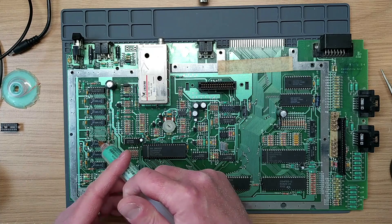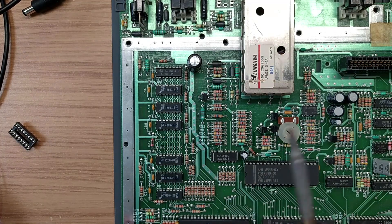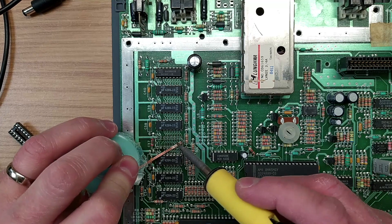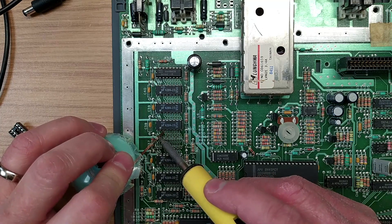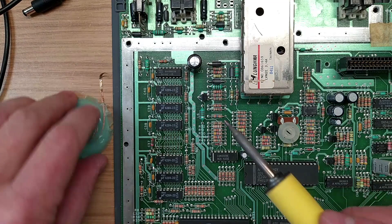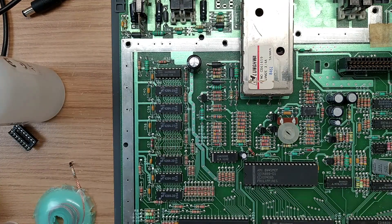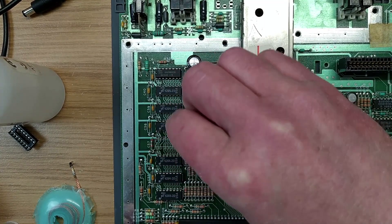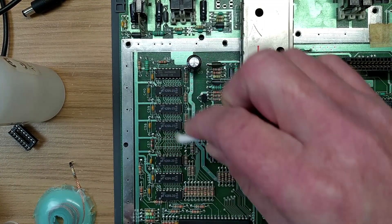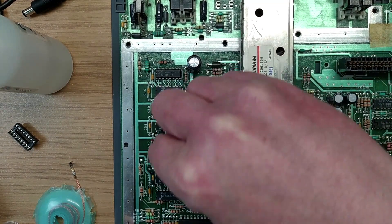I'm going to let that cool off a little bit, then we'll get some flux on the board and go over this with some wick. I'm going to leave the desoldering gun on standby because there's no guarantee this is actually going to fix the board - there may be more than one bad DRAM, regardless of SysCheck only telling us there's one. SysCheck is doing a very good job, but it is taking a best guess at the bad DRAM based on the position of the bits that failed the RAM test while writing and reading values to system RAM.